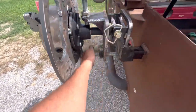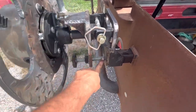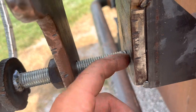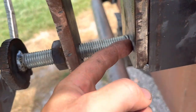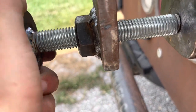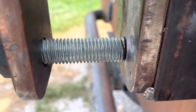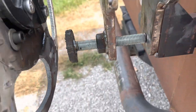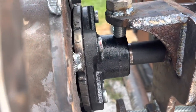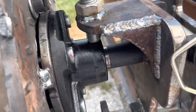On the pin, you could grind that down and make it more of a point so it wouldn't be such a large surface to align - as you can see, it's not going in super straight, it tries to cam over a little bit. If it were more of a point it would work easier. I've seen different ways guys do these brakes, and this one from the prints seemed like the most simple way to go about it.